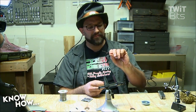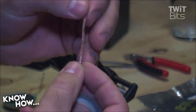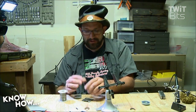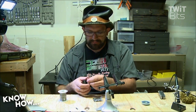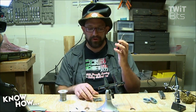Now there's solder wick. I make a lot of mistakes, so I always keep solder wick handy. Solder wick is literally just a copper braid - I'll hold it up to the camera. It's a little copper braid with holes in it, impregnated with a bit of rosin. If you make a mistake, you put the solder wick on top of it, push the soldering iron down on it, it heats up the wick and the joint, and the wick will literally suck up all of that solder, making the component much easier to pull out. I make enough mistakes to have two of these.